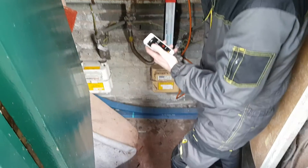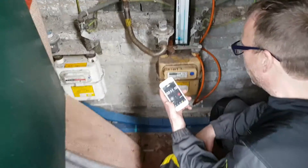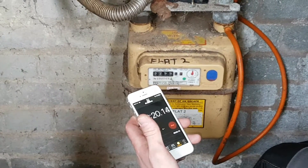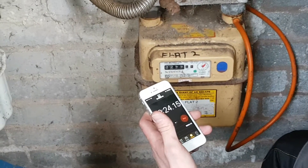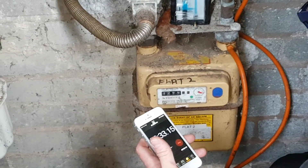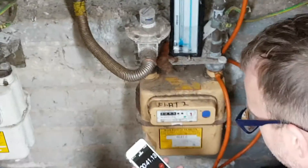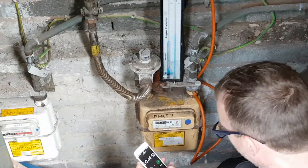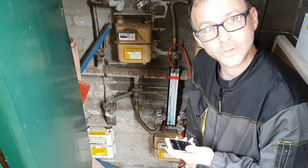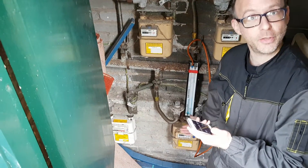What I'm doing now is my gas rate. As we can see, we have the gas switched on, the manometer still connected, and what I'm doing is timing one complete revolution of the dial on the gauge. We're nearly there — and there we go. I have my complete cycle, and it's taken 44 seconds to do one complete revolution for our gas rate. It's an imperial meter, so I'll be using the imperial measurements and doing my calculations for the gas rate using my time and the formulas for the imperial meter.